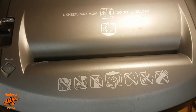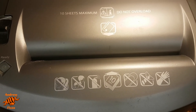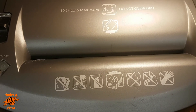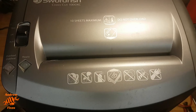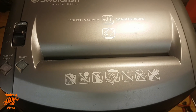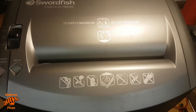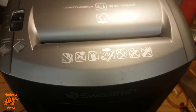So let's solder it in and see if it makes any difference. There you go — that's a Swordfish Crosscut 1000XC shredder. It had a faulty zener diode. I'll put the details of the exact diode that I used in the description. Fixed for the sum total of about 50p's worth of parts and a little bit of time with a soldering iron. And that is a shredder saved from landfill.